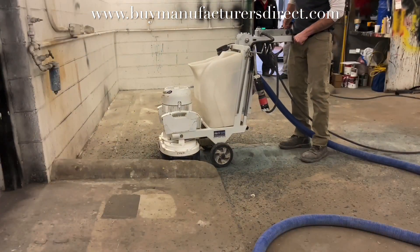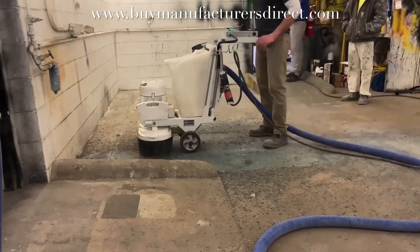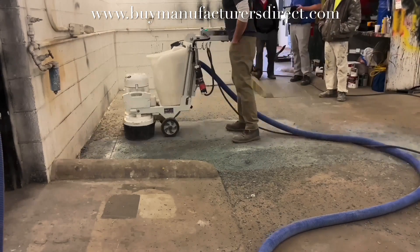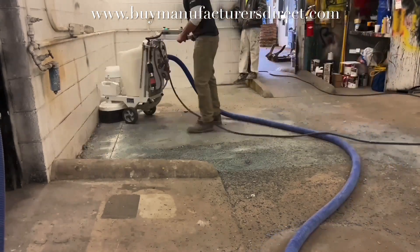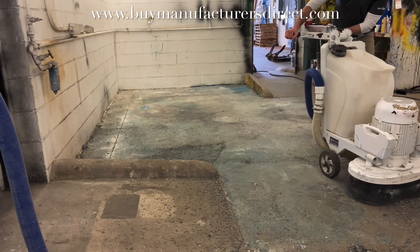The process looks like grinding. The machine has moved back and forth, two passes forward and backward — exactly the same as the grinding process. But with the PCDs, the aim is to just get that topical material removed from the surface.